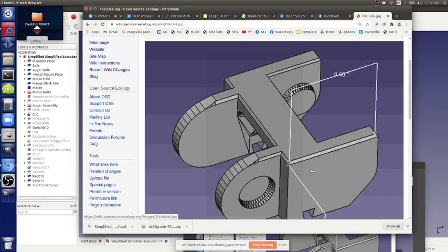So right now, the way the belts were, we were getting 17 without additional tensioning, right? We're getting 17 pounds per motor, so times 4 is 64 pounds of uplift with the tensioning that we already have. When we pressed harder on the tension, we were getting like 27 pounds per motor. So with a counterweight, we should be pretty good at this point. The counterweights need to be the same weight as the bed, basically, and that would neutralize your forces there.